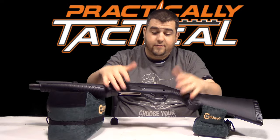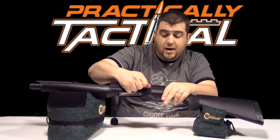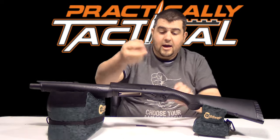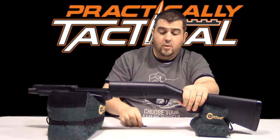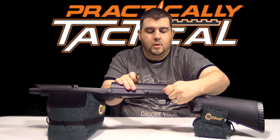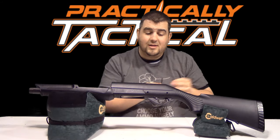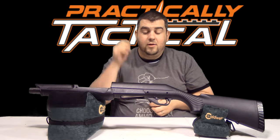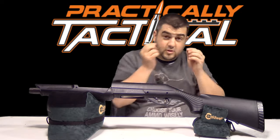If you just got your firearm or it's relatively new, this could be kind of difficult. If you can't physically pull it out, there are a couple of things you can do. You can take your cap — it's teethed — so you can use it to pull up on the pin, or if you can get one pin out, use that pin to push out the others. Now, these pins are actually different sizes, so you want to set them the way they came out. The longer pin goes towards the front of the shotgun, the shorter one to the rear.